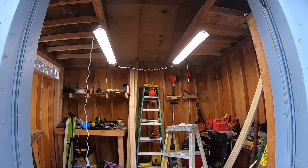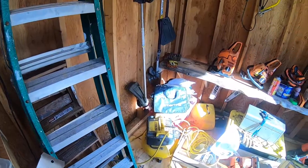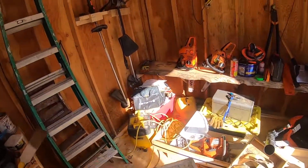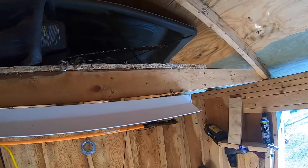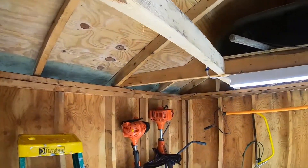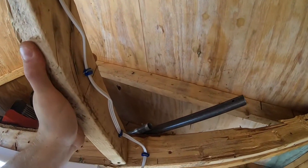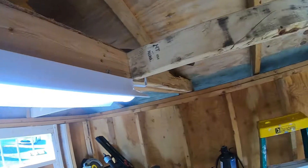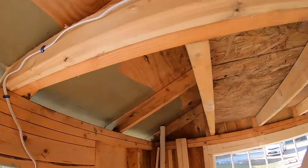Just a little update on the shop lighting. After I was in and out a few times, I actually needed the ladder to fill the bird feeders and I almost pulled all the lights off because the ladder got hung up. So what I did was I raised and flush-mounted the lights. I ran a two-by-four — we've got a million two-by-fours so I don't care — and then I stapled the connecting wire with electrical staples.